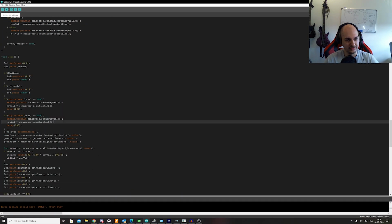If you want to know what functions are available, I have nav1, com1, com2, and the swaps for those. That's just the baseline to work from to see if this works. If you guys find any issues, let me know so I can fix them. And I'm going to be working on adding all the buttons you can imagine as an input as well, so you're able to really communicate with your game in a snappy way without being dependent on an Arduino Pro Micro Leonardo or having to spend hours flashing your ROM to work with an input, and it just works out of the box. You could even use something other than an Arduino that uses serial communication, as long as you're able to send commands over a serial line at a baud rate of 115200.